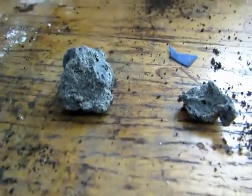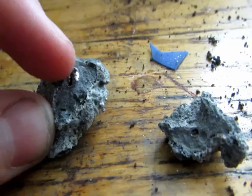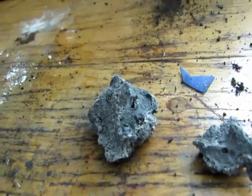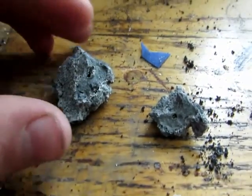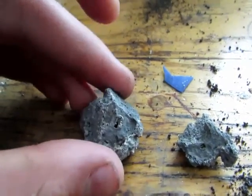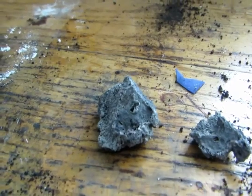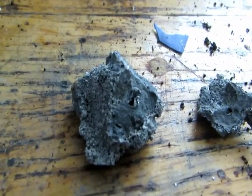After breaking up the reaction mixture, we did indeed get some calcium metal. You can see this little pocket here, and the shiny metal part right here — that is indeed calcium metal, and it's actually crystals of calcium metal, which is kind of interesting. I guess it's just the way it re-solidified after it was probably liquid from the high temperatures. There was also a teeny little one down in here. I think it's quite pretty just as is, so I'm going to put this on display. It is true that you can indeed make calcium metal from the reaction of calcium sulfate and aluminum powder. I'm pretty happy with this — that is how to make calcium metal.